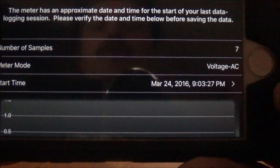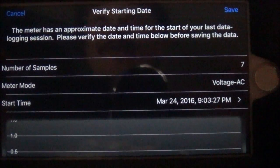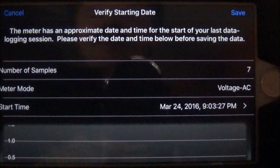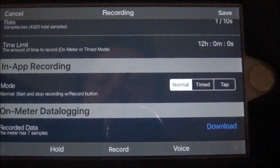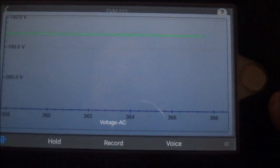It'll show you what mode it was in and how many samples were taken. This can take 20,000 samples, guaranteed. Once every 10 seconds, that comes out to 55.5 hours, I believe. A sample every 2 seconds gives you about 11 hours of recording. Once you have those, you can go back